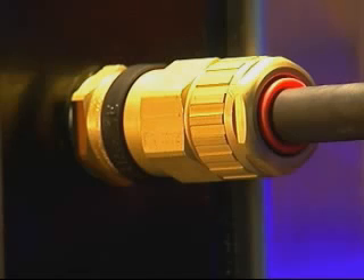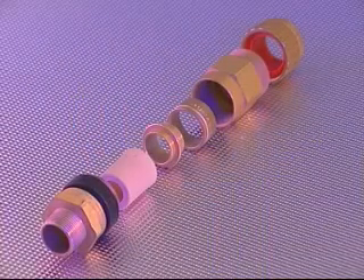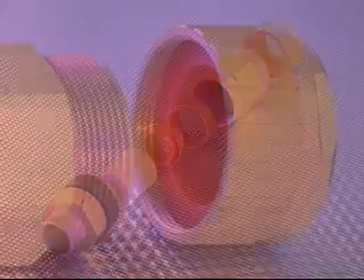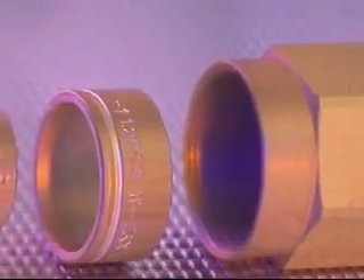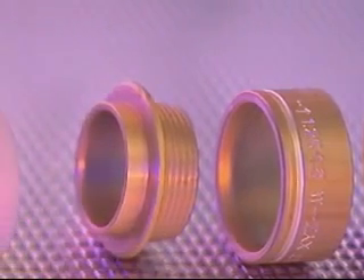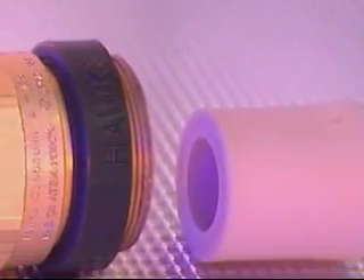General Description of Glands. The ICG 653 Universal Cable Gland comprises six major components, these being the back nut, middle nut, reversible armour clamping ring or RAC, armour spigot, compound pot and entry component complete with deluge seal.